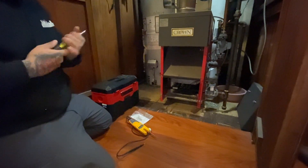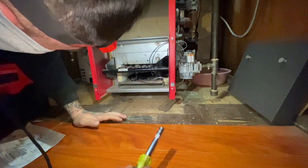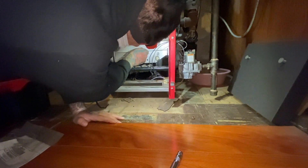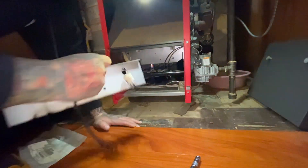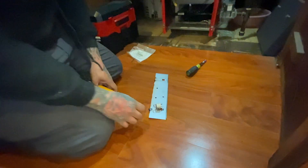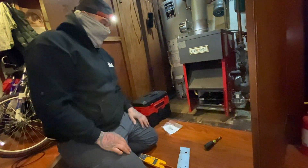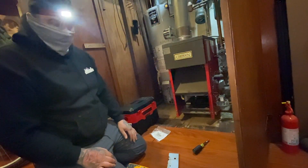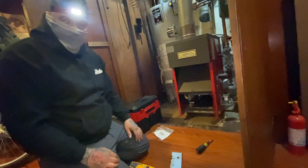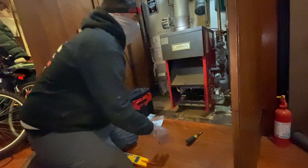Now I'm gonna replace it. I'm gonna put my head on — I'm gonna put my head away so I can take this out. I'm just gonna take the whole thing. This rollout switch, if it trips, it saves the system from burning anything out — we could have caught a fire. But due to the lack of maintenance, the burners are bad, so I'm gonna pull the burners out. I'm gonna turn the gas off.